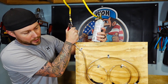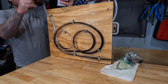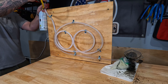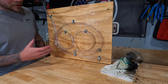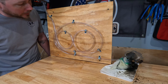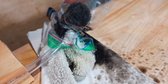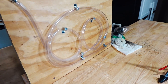Three, two, one. I had a problem — I did not have a good seal up here, so let's put a little bit more in. There we go — that's a good seal. I didn't have the cone on the first time. Dude, I don't even have to hit it with nitrogen again. Look at this — that's just straight up clean. Now we just got the rest of the residue and the flush in here. Look at this — all the walls are clean, everything is clean. It's all gone, it's all into this rag. That now needs to be thrown away. Just one shot — I don't even have to follow it with nitrogen to get the oil out.